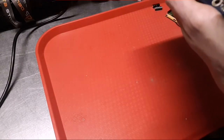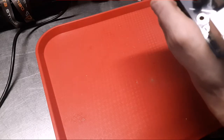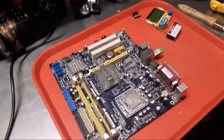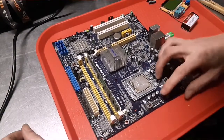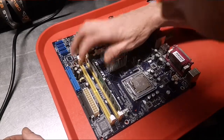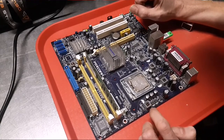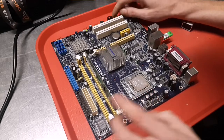And I'm trying to see what they are, and they're weird too. 680 uF 4 volts. There's no way in hell I got those either. This one is an odd one. So we definitely won't get this board repaired today, but it is good that I saw them. Now I'm going to go over all of the caps with a fine-tooth comb. And that one's okay. But I'm going to pull the schematics out if I can't tell right away what circuit these are in and what's going on.